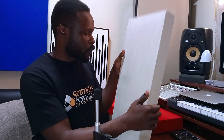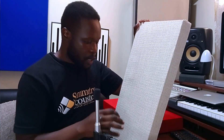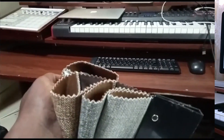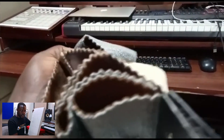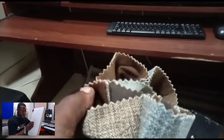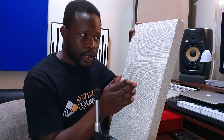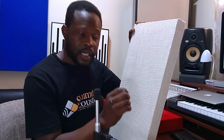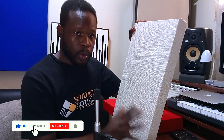Let's start with the fabric. The fabric used to wrap this kind of panel has to be very porous — it has to allow enough airflow into the panel. It should not offer any air resistance, because if you have air resistance then you have minimal sound passing through it and that compromises the performance of the panel. I see a lot of guys using a fabric like this one I'm holding here — this is a sofa fabric. It's not recommended because if you look at it closely you can see it has two layers. The outer layer gives the physical appeal and the second inner layer provides strength for sofas, but the problem is it has very minimal airflow.